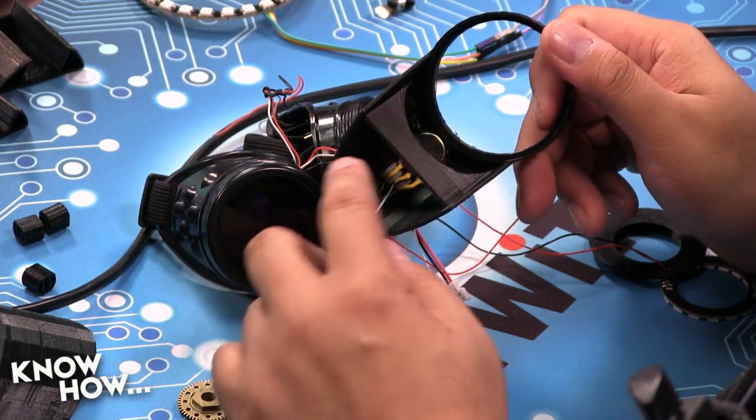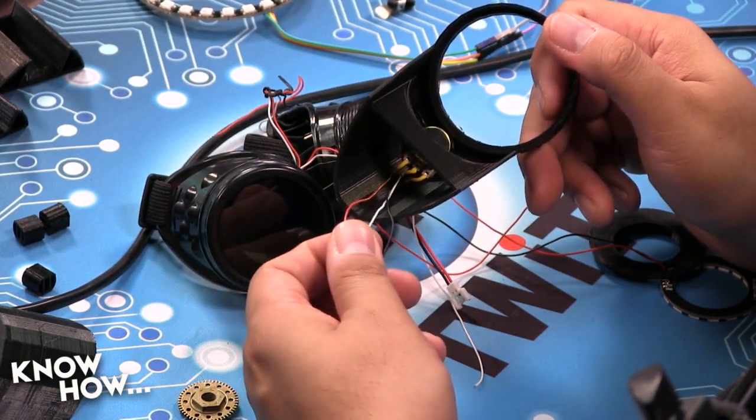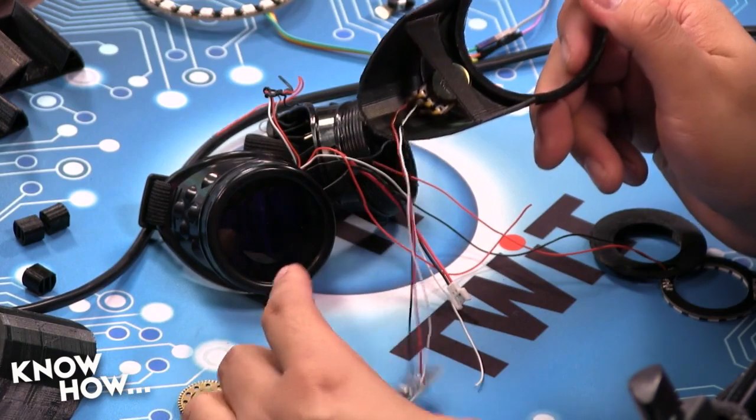So what we did yesterday, and this is what you still have to do, I've got my potentiometer. I've got my three wires. If you go to the side view, I've got my three wires coming out. So I've got my ground, I've got my 5-volt, and then I've got my signal line from the wiper coming out of my potentiometer.